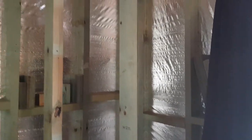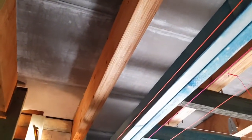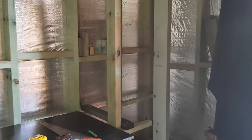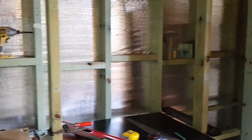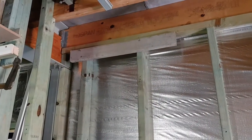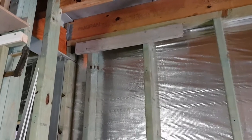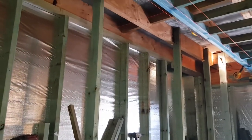Yeah, 25 mil. But I'm not going to do it from this side of the joist, because once I start building towards the wall, everything's going to be out, so you're better off just doing it from the wall, if that makes sense to people. It's interesting. I wasn't expecting that, but I knew it was going to be out by a little bit. But 25 mil, I don't know. Well, I guess that's 25 mil over 5.5 meters.